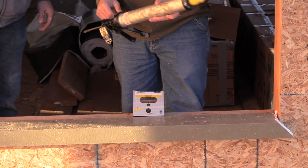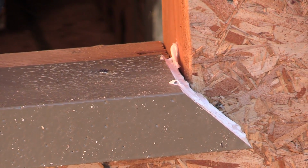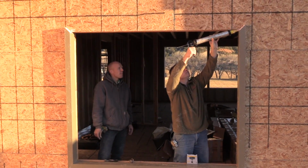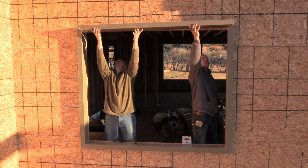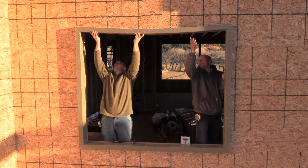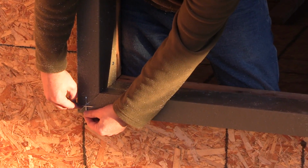We've got a nice porous area where we cut the ThermalBuck, and then we go straight into installing the jamb pieces. We're going to go with the head piece finally. Getting a Dow 758 put on. That locks that joint very tight till the sealant sets.